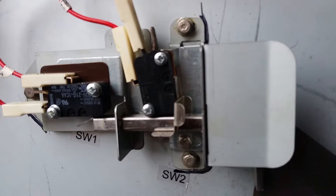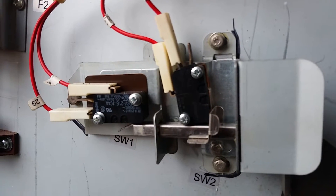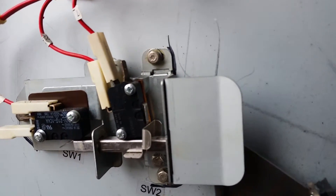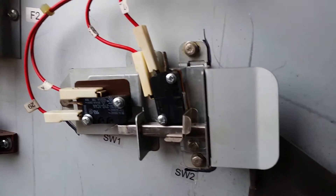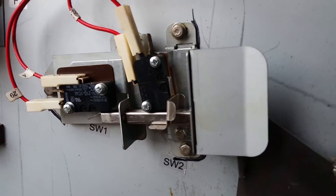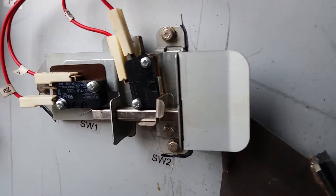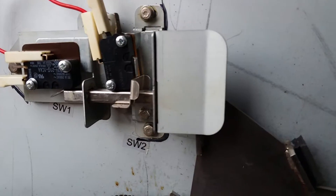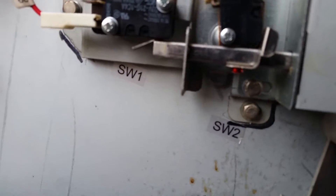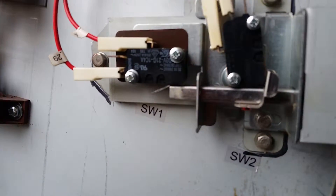You can see a little delay between switch 2 and 3. On the other side I'm not sure if you can hear it but I can. When you open it fast — in a rush during cooking — switch 2 and 3 open together. A little play between switch 2 and 3 is not very important, but be sure switch 1 opens and closes alone, not at the same time as switch 2 and 3.